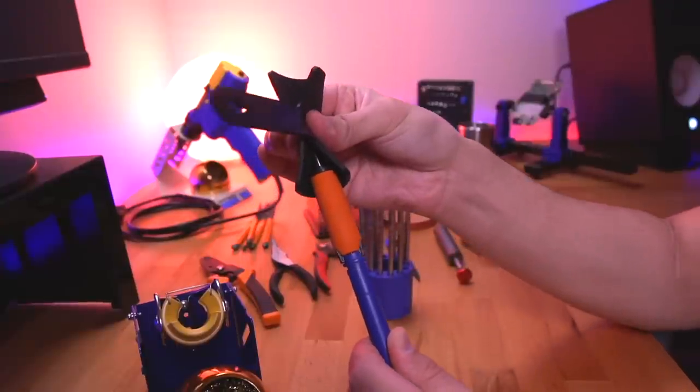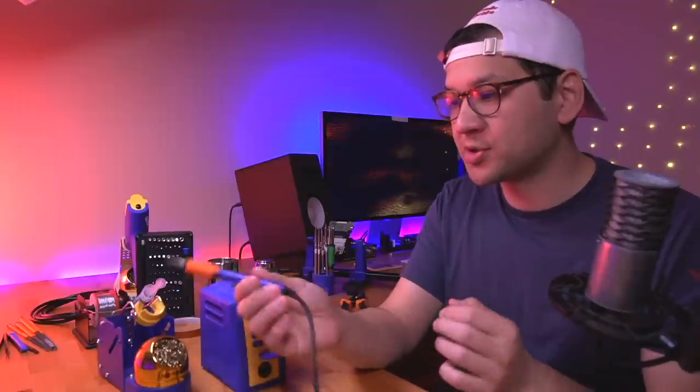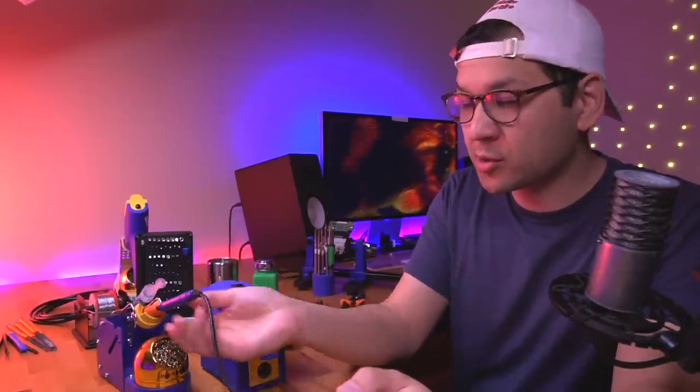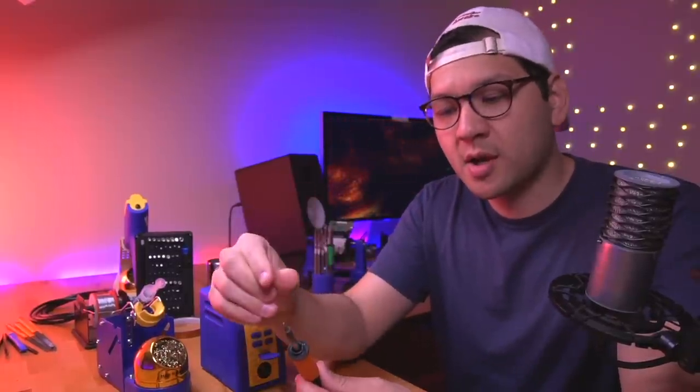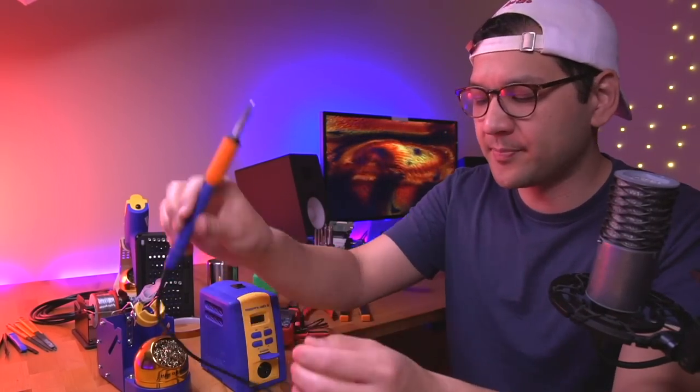You may be asking why you'd want hot-swappable tips. When you're doing mods, you run into different scenarios where different tips are advantageous. For example, if you're soldering to a pin, a chisel tip is good, but for drag soldering you might want a knife-edge or J tip. Swapping tips on the fly saves a ton of time. A lot of soldering irons require you to turn it off, wait for it to cool, unscrew a tightening screw, remove the tip, put on a new one, and turn it back on — that wastes a ton of time. You do need to be careful when removing a hot iron tip.